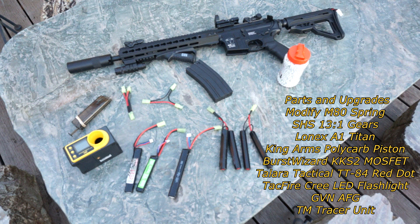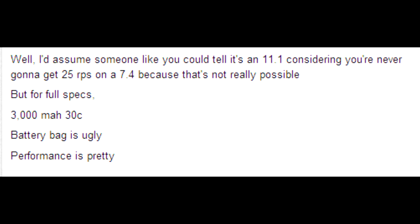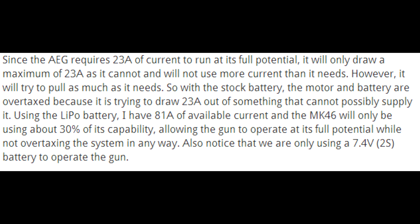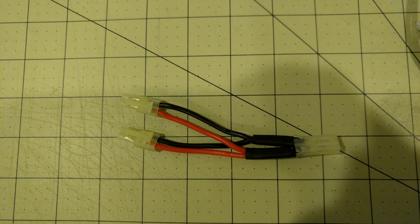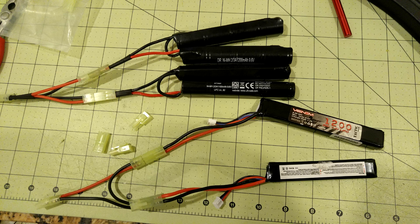The reason being is that the easiest way to increase RPS is to shove a bigger battery into the gun. This is where things sort of fall apart, as a lot of forums say to shove in higher voltage batteries, while others say to use high amperage batteries. So this test is pretty much to show what high voltage and high amperage will do to your RPS. I've even built custom battery connectors — one in series, which effectively adds the two voltages of your batteries together, and the other in parallel, which effectively adds the two capacities of the batteries together, which in turn increases your amperage.